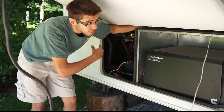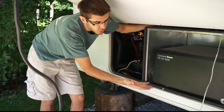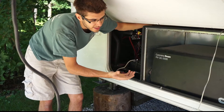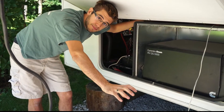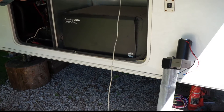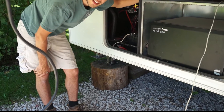I have already climbed up in there and removed the old landing gear system that broke. We had to jack up the fifth wheel and get it to a high enough elevation that we could actually disconnect and drop the landing gear out the bottom. So we're going to start getting the parts and pieces together and show you how to get it replaced.